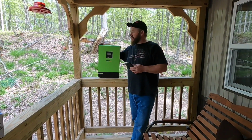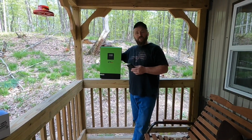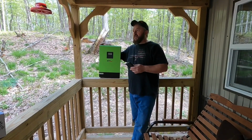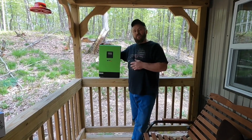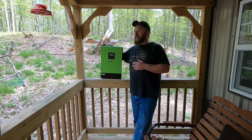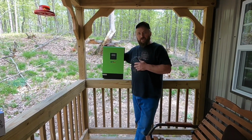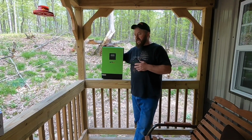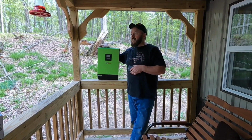I will also show you how we are going to reduce this down from a 24 volt system to a 12 volt system, because my cabin is already wired in 12 volts. So we need to make accommodations for that. And you may ask me, why did you just go ahead and order a 12 volt system? Well, because a 24 volt system is far more efficient, and it's cheaper just to go ahead and buy a $30 24 volt to 12 volt reducer, and then have the extra power just in case you want to add any extra features to your cabin. So all around, I think this is going to be the best setup for the cabin.